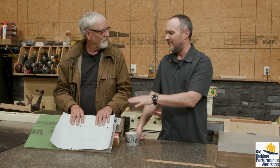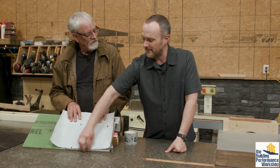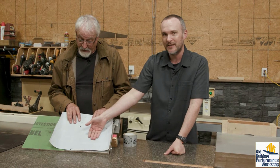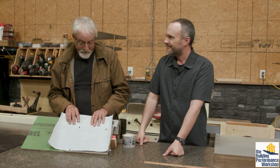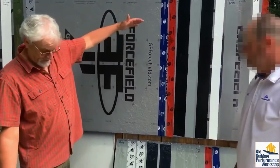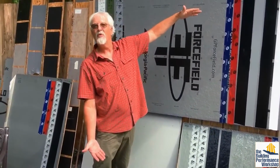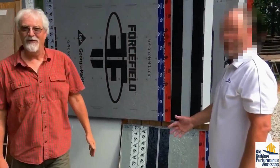Are you talking about a brand like Tyvek, Typar, or any of the others? Often it'll be the same: you'll have to void the warranty if you seal this bottom seam. Is that right? Because they want any condensation that's back there to be able to drain out. It's got to drain the water that gets behind it. Out in the wettest place in the United States, in Washington, the house looked like a pregnant house because it was holding so much water. It was a belly. It had a moat. It had a belly full of water.